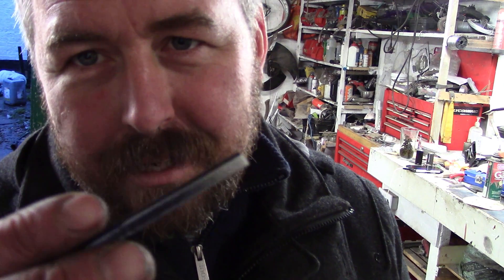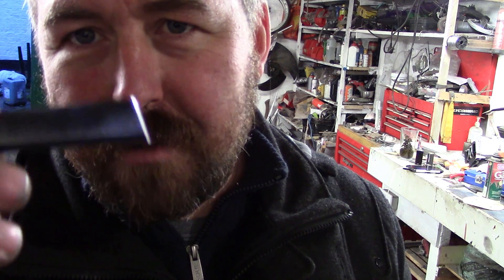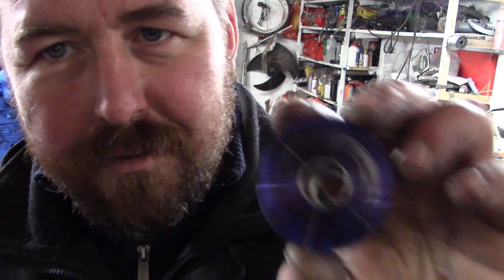I've made another cutting tool — hardened and tempered O1 tool steel. It's a slightly different angle. No relief on the sides because I want it to follow its first cut. So it's going to be like cutting that internal keyway, but I've got to index it, so I've already marked it up.